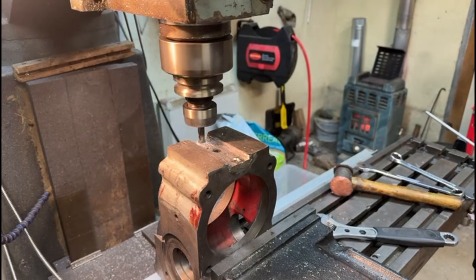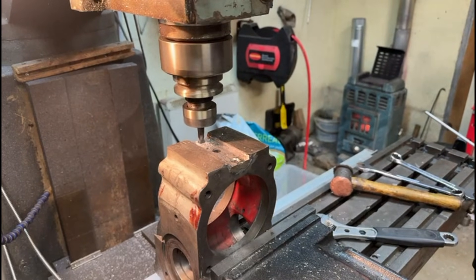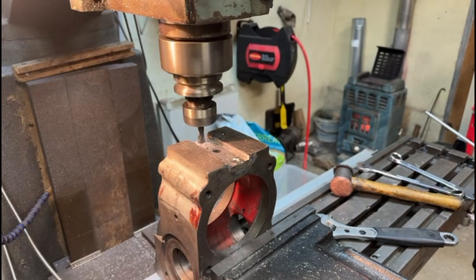It's making some horrible noises, but I kind of expected that because the weld, as I said before when I was machining this with the milling cutter, the weld leaves hard spots in it. So the drill doesn't like it very much, but I'll get through eventually, I think.